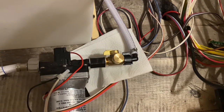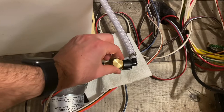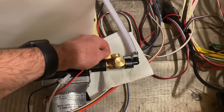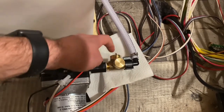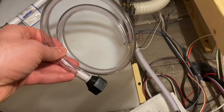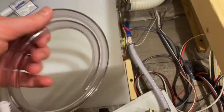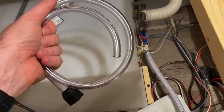So that's it. Whenever it's time to winterize, you'll just take this section off right here, turn the valve to bypass, and they've provided you with a hose here that you'll install, and then you feed your antifreeze into this tube.